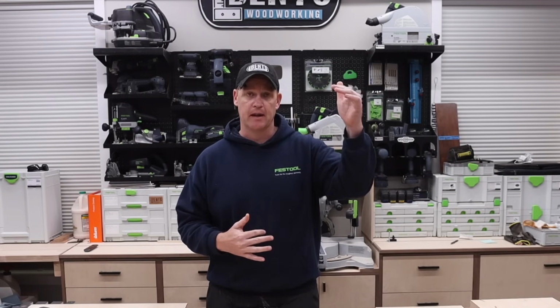Let's quickly go over some common sizes that you're going to find with a traditional upper cabinet. Typically, upper cabinets are going to be anywhere from about the 30-inch range to the 42-inch range if it's a single standalone cabinet. And then things can vary based on, let's say you want to build a 30-inch and then you want to build like a 12-inch separate cabinet above it for additional storage or something like that. The common depths that you're going to find with upper cabinets is 12 inches to 24 inches. And then some of the common widths that you're going to find are anywhere from 9 to 12 inches all the way up to 36 inches.